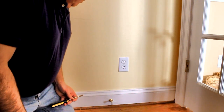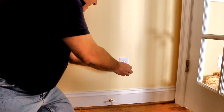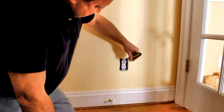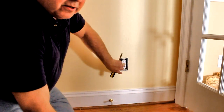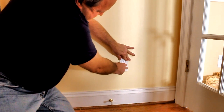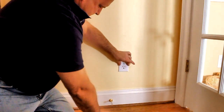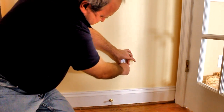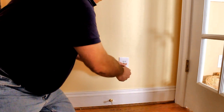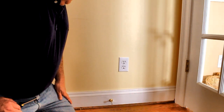We're going to start off by removing the cover plate here from the electrical outlet. The power is not off — we're not going to touch any of the wiring in there; it's kind of like if you were painting your walls. You can see here that space we were talking about — I can slip a pretty big blade on that side of it. This is up against the 2x4, but I've got a gap around this that's open to that outside wall, and I also have wiring spots on the inside. So pretty simply, I'm going to put this in place, put this back on top, take our mounting screw — it's foam insulation so this is going to compress it back in. And there we go. We've insulated this socket for airflow, and it's something pretty much anybody can do who can use a screwdriver.